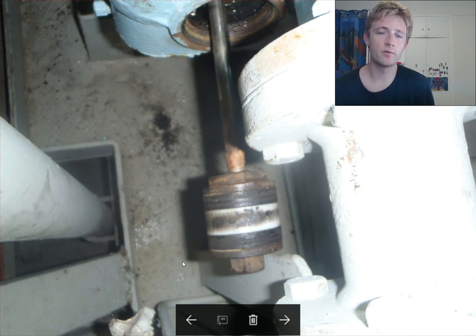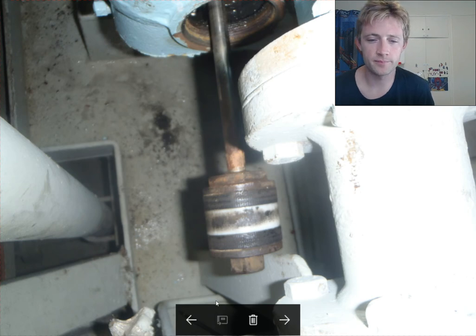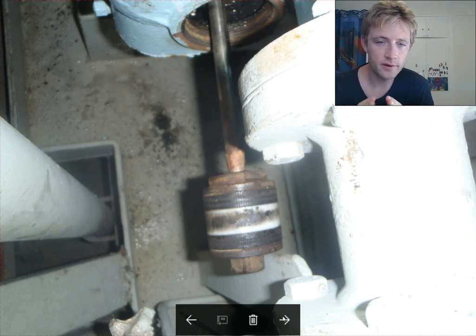When you do an overhaul, this gasket must be replaced, and the paint must be cleaned from all sides with sandpaper to ensure the contact is perfect. This surface must also be in perfect condition and examined carefully. The studs must be cleaned and greased — or better, Molykote — because you must be careful, as this oil bilge pump transfers to the oil-water separator.